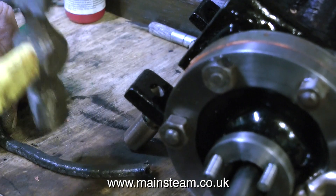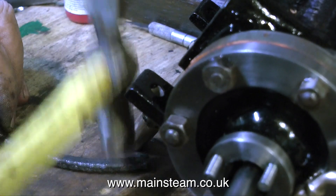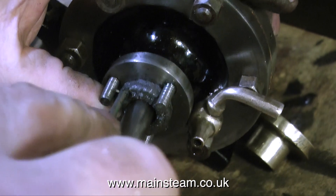This is really good quality graphite yarn — far better than the stuff you buy now. I'm using a hammer to flatten it out slightly, and then I wrap it around the piston rod. Carefully, using a small screwdriver, I persuade the graphite yarn to go into the gland itself.